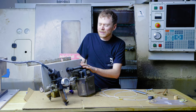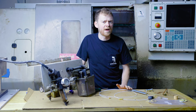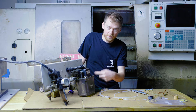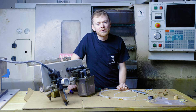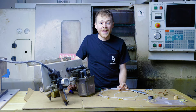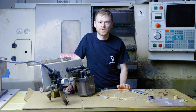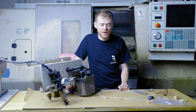To start with, this is the lube panel on the back of most machines built pre-2002 era. Your machine probably doesn't look this pretty. The system has a lube panel right here that'll then pump lube throughout the machine. It gives lube to every linear truck, it gives lube to the ball screw, and to the spindle. If you have a mill, a three-axis mill, you're gonna have five lubricating points on each axis — four for each truck, one for the ball screw, and one more for the spindle.